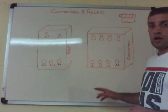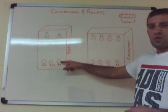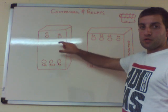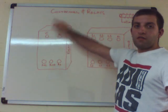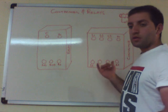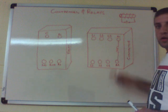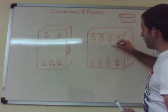The output end goes to a device such as a motor or compressor. In terms of a relay, it's the same — A1 and A2 for the coil, though on a relay they're typically labeled numerically. You also have a common, where the live feed comes in, and then a normally closed and a normally open contact. Inside, you'll have a coil between A1 and A2, and contacts for the contactor.